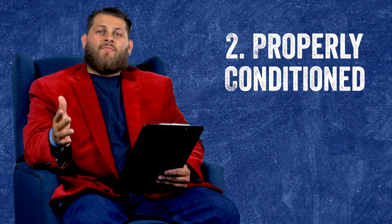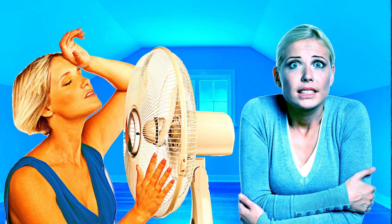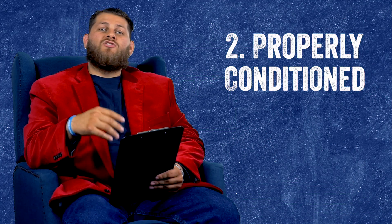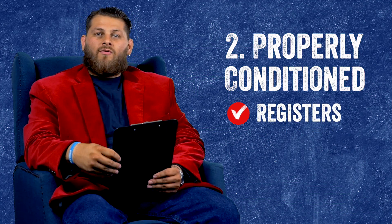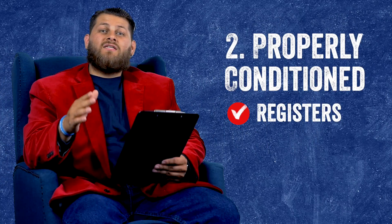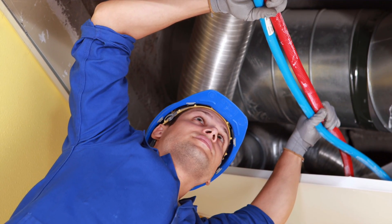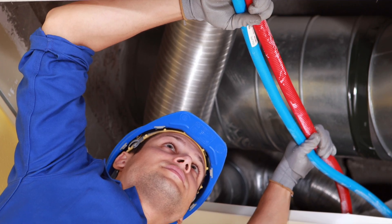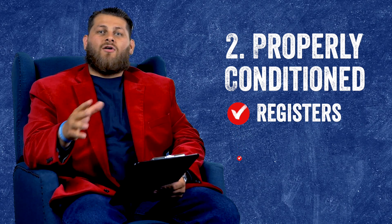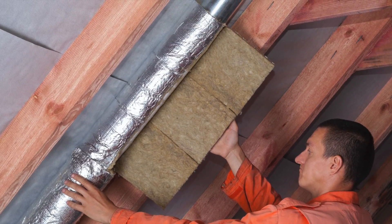Another thing to keep in mind: if that room over your garage or bonus room is really hot or really cold, it may not be properly conditioned. You may not have proper heat registers flowing to that room during the winter, or you may not have AC flowing to that room during the summer. This is very common — a lot of times when these houses are built, that bonus room may not be intended to be a living space initially, so it's never designed or installed to have heat registers or air runs to that space. If that's the case in your home, you need to consult an HVAC contractor and see what it would take to actually run those registers to that space.